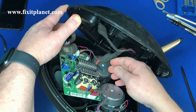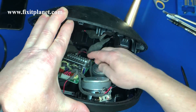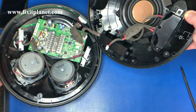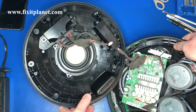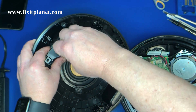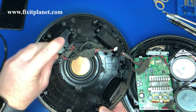Wiggling it doesn't work — they're actually locked in place with little locks. You have to squeeze the little tab on one side of the connector and it releases it. Now there's a battery underneath that's still connected — we didn't disconnect the battery; that's still connected and it's underneath this plastic cover here. But we're going to work on this other plastic cover — it's got three screws to get access to the DCN board and see what it looks like.